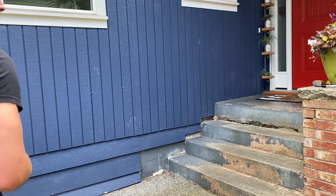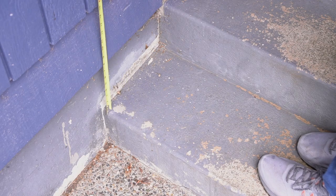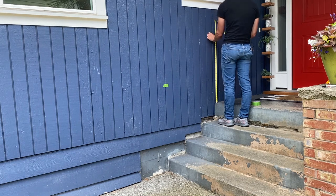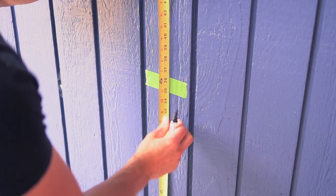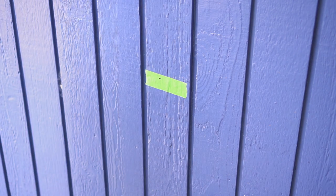I've featured this front entryway in a number of different projects already on my channel, but I haven't finished it out yet, so I'm going to be working on completely renovating this entire space. Now, with this being a handrail it needs to be code-compliant, which basically means the height of the handrail top needs to be between 34 and 38 inches. I'm setting it at 36 just to be right in the middle.